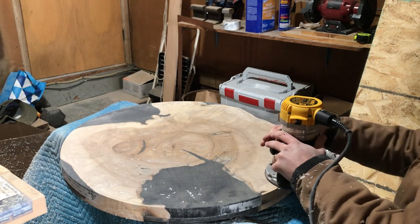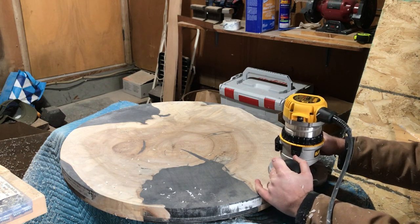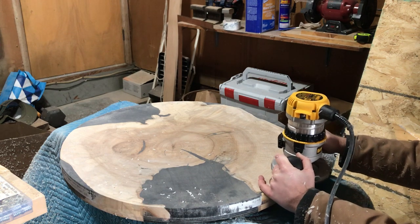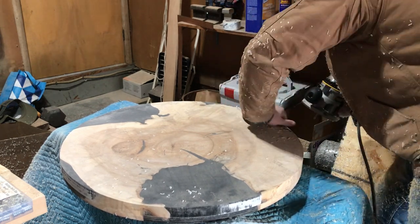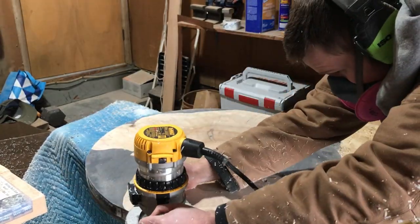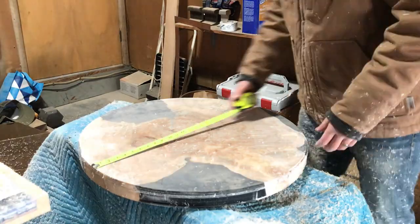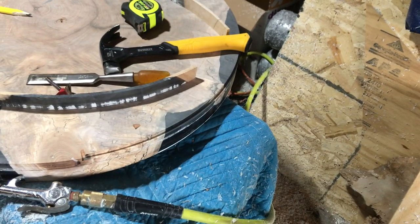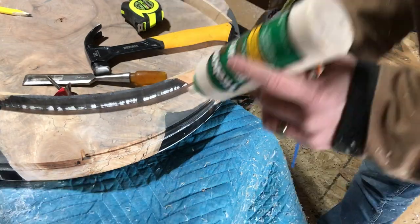I took the piece to the shop — it came back very nicely sanded. I'm using a flush trim bit to get a perfect edge. I also made a homemade circular jig, which worked out perfectly — I've since gotten a nice one from Rockler. The flush trim bit is an awesome way to get a perfect circle. One thing I didn't realize is that the flush trim bit isn't very long, so with a two-and-a-half inch piece I had to route at least an inch down with the circular jig first before the flush trim bit was actually long enough to reach.